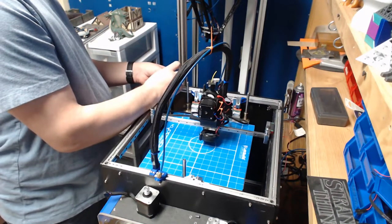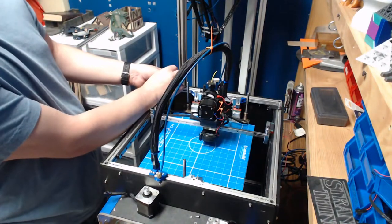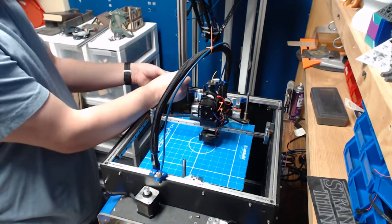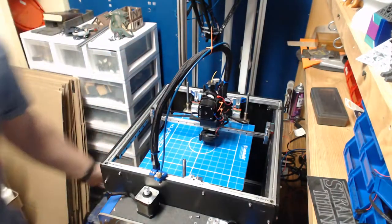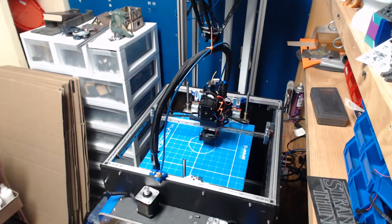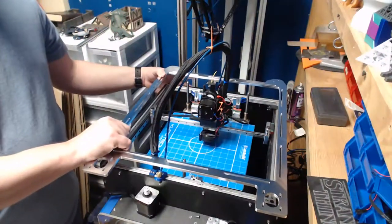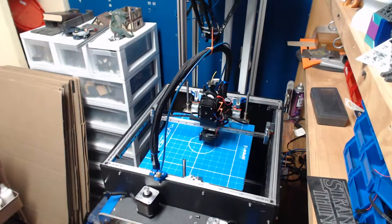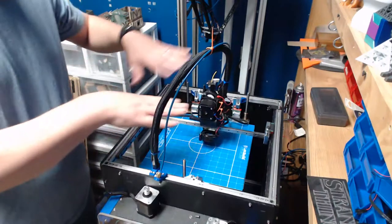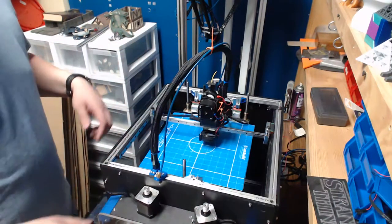So the idler side, and the stepper side too, are the big changes with the halo. Hey, Greg. So the halo is what I'm calling a solid ring of aluminum that will fit around the top of the printer and have integrated stepper and idler mounts, and also act as a giant bracket for the entire top, because right now the top is the only side without a side panel on. So it'll be a giant L bracket essentially for the whole top.